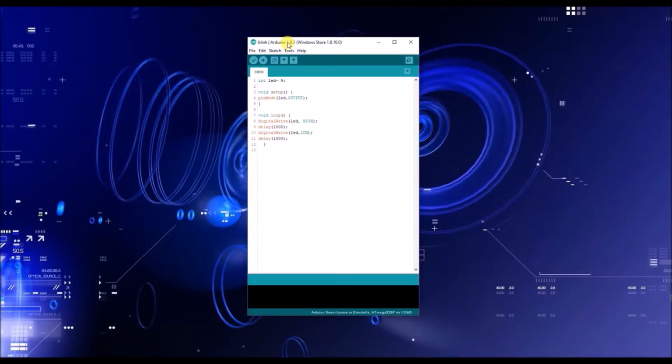All right, so if you look in the description of this video, you'll actually see this piece of code. This is what you want to insert into your Arduino IDE. One thing you want to make sure of before you connect it is that the jumper, it has a little jumper on it, make sure it's connected to your 5 volts. All right, so once you have the jumper on 5 volts, you want to go ahead and put the micro USB cable into your FTDI.